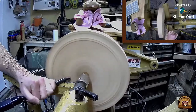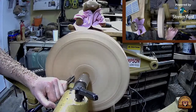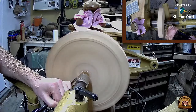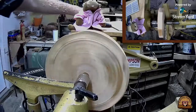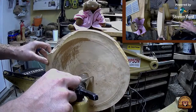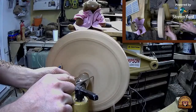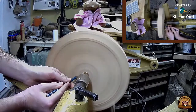For those of you who are just joining up, Hodge has a piece of maple that has some burl figuring in it and he's going to turn a nice little platter. I've got the base fairly flat, at least at the center point. Now I'm going to go ahead and use my calipers to mark the mortise. I want to get it fairly small so it fits the jaws while they're open, and I'll use a pencil to highlight that so you guys can see it a little better.